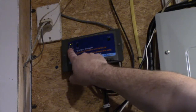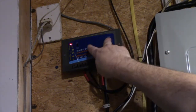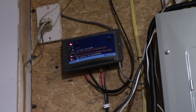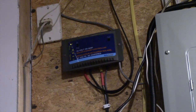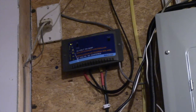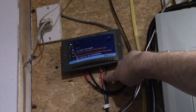I can press the test button and see the lights on the batteries — they never totally top off on a cloudy day after a couple hours of use, so they drain down a bit. I have three 100-watt panels with the newer style MC4 connections wired in parallel. Once it hits the charge controller, it regulates and feeds into the battery bank.